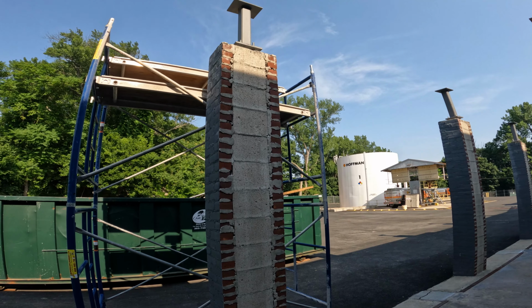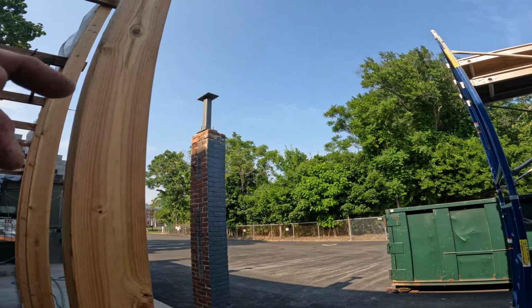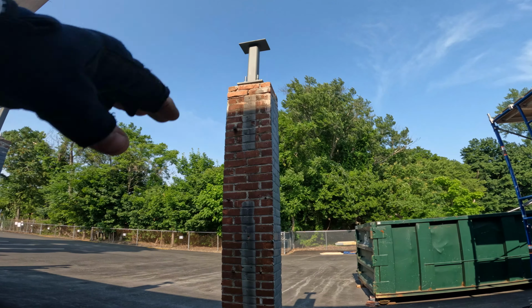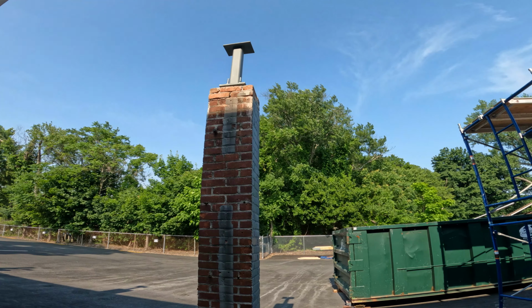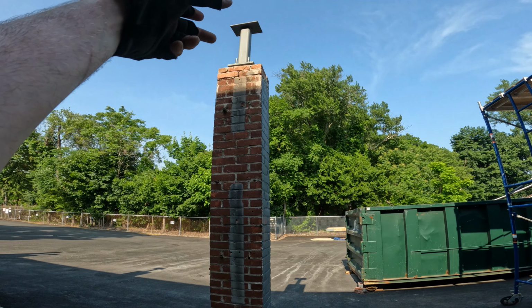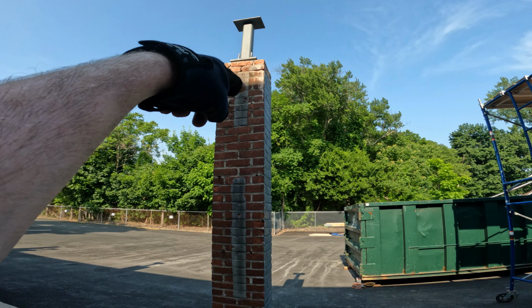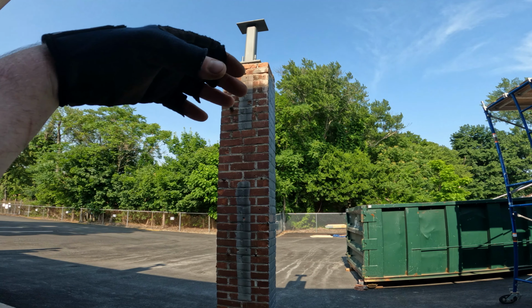And we're gonna weld the beam up top. And then we're gonna take this post, we're gonna shim it up somehow, hold it up, clamp it, whatever we need to do to get it flush on the bottom of the beam, and then weld it. And then we're gonna build the bricks up and drop, we're gonna keep those anchors going out the base plate at the bottom, and then we're gonna pour mortar inside and let that harden up.